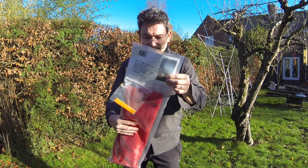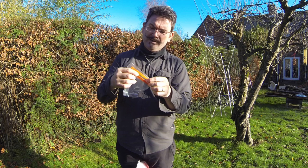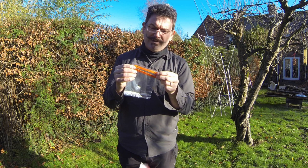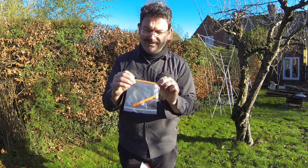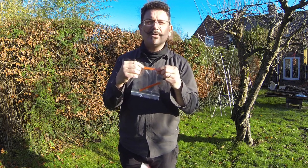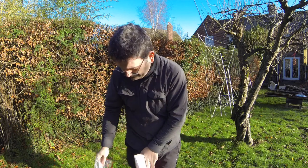Let me start with a quick unboxing of the actual antenna. It comes with a couple of spreaders and a couple of separators which are going to go between the driven elements and the reflector. They're laser cut out of what looks like a Perspex or PVC-type material, and I can see that Richard has scored marks on the surface of these - I think that's going to be part of measuring and getting the elements the right length.